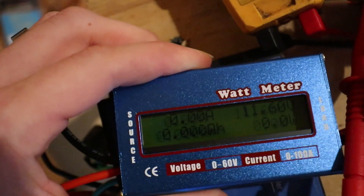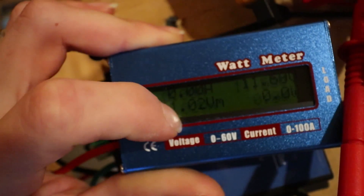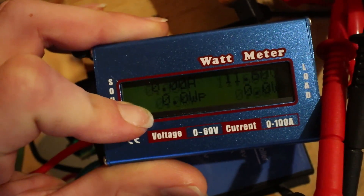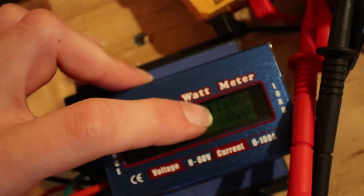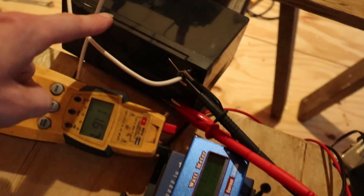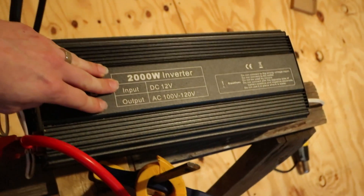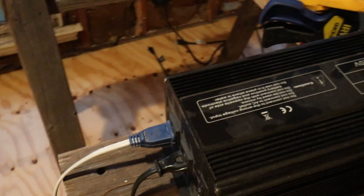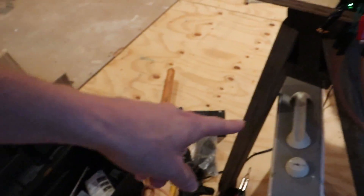Going to my monitor here: the battery is sitting at about 11.6 volts and we've got zero watts going across. This will cycle between the max it's seen. The top left shows amps, top right shows voltage — that will show me the power leaving the controller through my meter into my battery. From the battery I've got a 12 volt inverter — a little overkill for today — and from the inverter I've got a box fan. I can change the speed on the box fan, and I believe it was running around 150 to 200 watts, which should be quite sufficient for our test today.